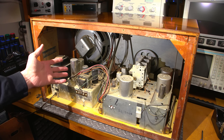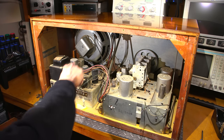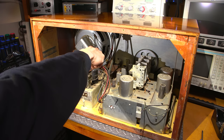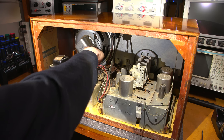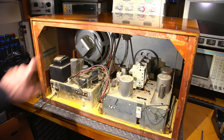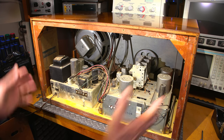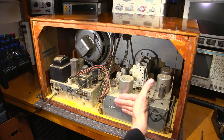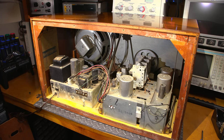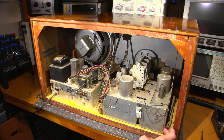It has push-pull output with two 6V6s driving an audio output transformer. There's a tube in the back — probably a 12AX7 or 12AU7 — and what looks to be a rectifier tube. There's a legend right here we'll take a closer look at. The thing is just massive. Look at the size of my hand — it's the size of a small television. The chassis appears to be mounted on some kind of interesting rubber bushing mounting system, and the bushings are still soft.